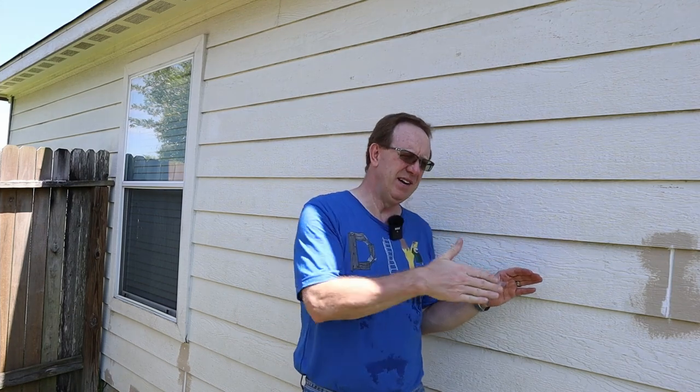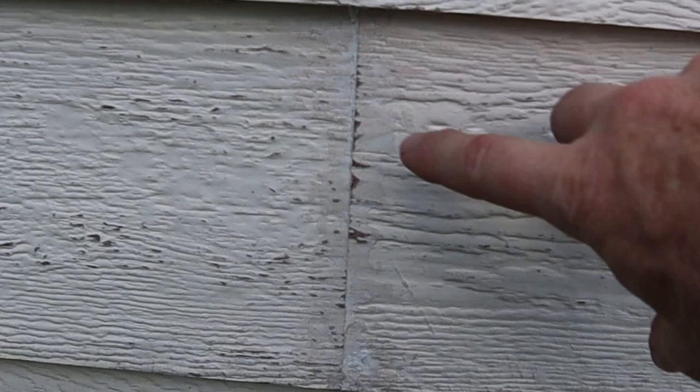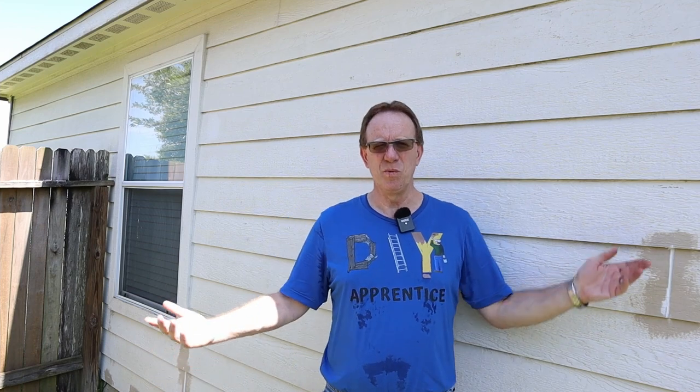When I got ready to do this project, I noticed that the siding was bowing up and down and back up, and in the middle of that wave was a butt joint or seam where the two sidings come together. When I investigated further, I found there was no gap. You've got to have a minimum 3/16ths inch gap between the two boards. I don't know over the last 12 years if through expansion and contraction the seams just closed, or if they were lazy when they installed it and didn't put an expansion joint in at all.